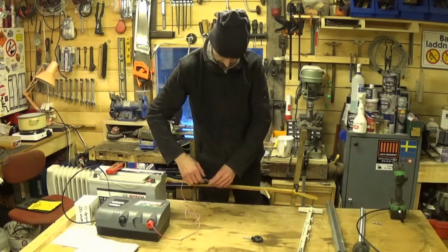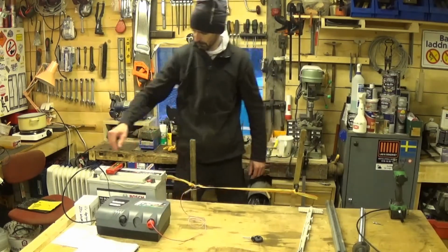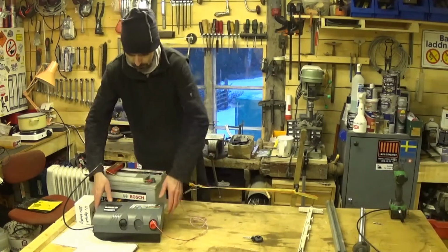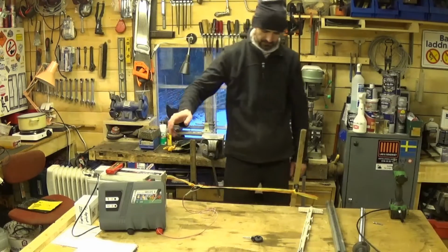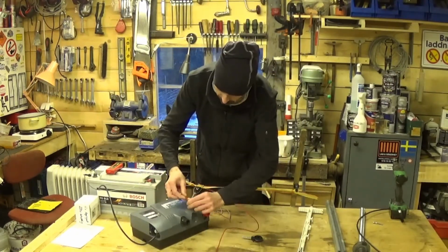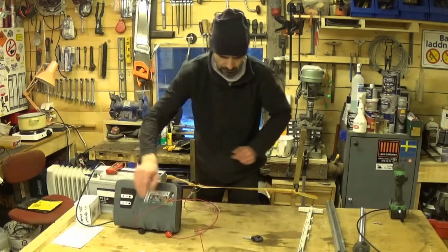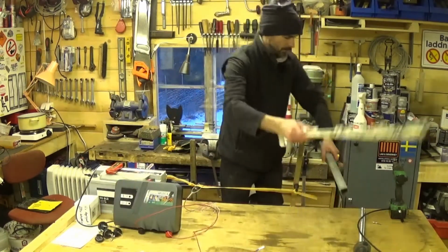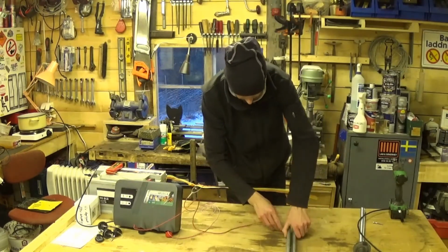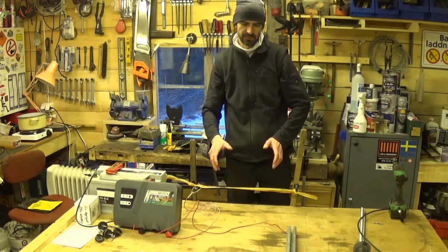Connect that up there. It's a bit bent. There we go. That's lived kind of a hard life out in the field, so it's not new. There we connect to our power source. That's clicking and flashing, so we know that's going to work. And then we need an earth. So here's our earth pole. That's connected. Now, this right now is a functioning electric fence.